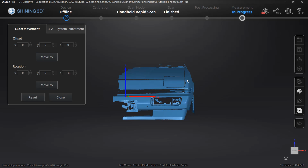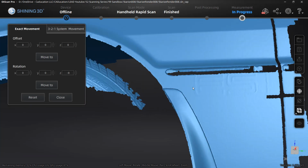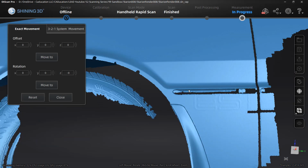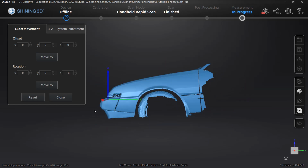it is going to be a much better situation, because if I had scanned, let's say, a plane on the floor, if I'd laid down some cardboard or something and had tape lines where X and Y are, that would give me a great reference. I do have things like the ES logo, which I could potentially use for a vertical line reference, or these bumpers on this car are horizontal with the line, so I could have potentially picked up on some of that. However, those are not true lines in the sense that they're pointing along the Y-axis. So again, having those references is important.